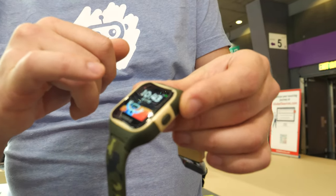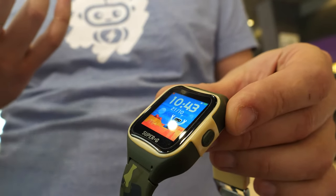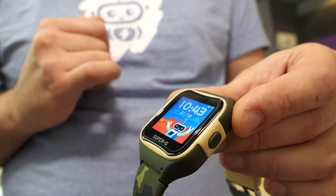We're also looking at e-ink display technology for the future, but for kids it's a problem — they want nice saturated colors. Also, e-ink won't help much with battery because the most power-consuming parts are the GPS and the GSM network module. Switching to e-ink or memory LCD would only gain maybe half a day — it's not a significant improvement for this type of device.